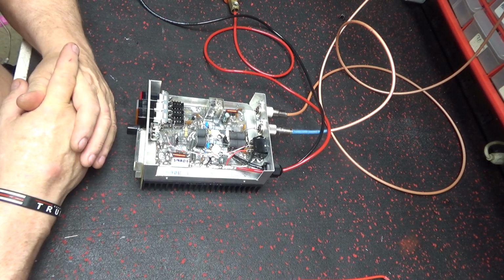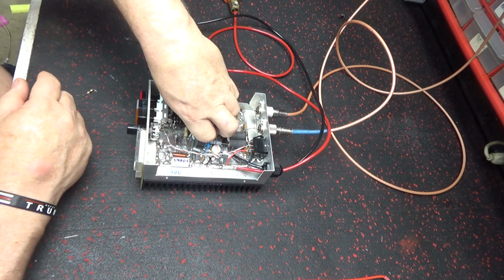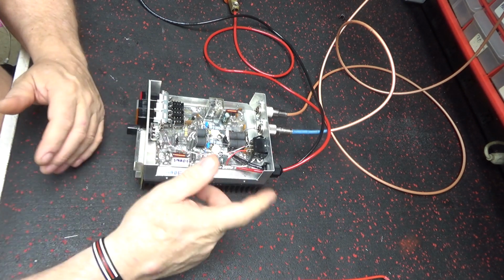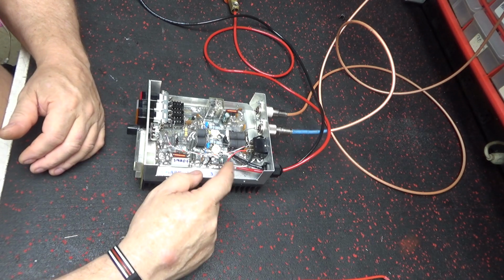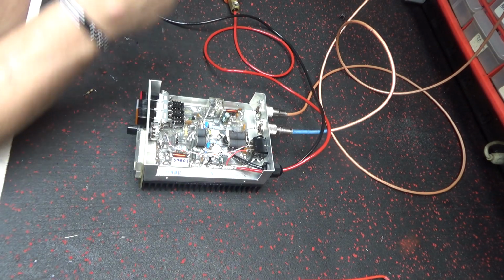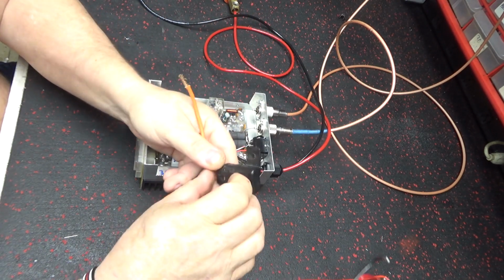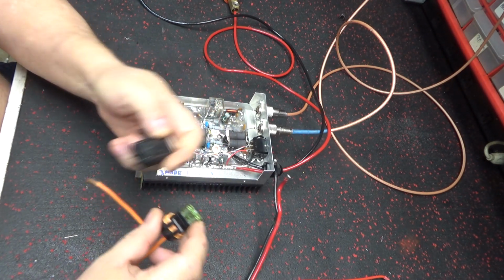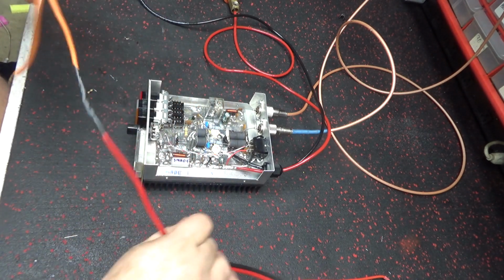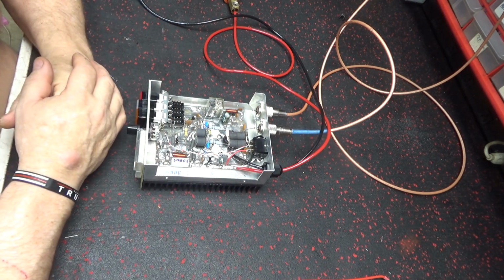And Texas Star parts is getting kind of hard to get now. If you ain't refurbishing them, mining for them or whatever, they're just getting hard to get. But anyways, I put a new transistor in it, added a diode here, put new power wires on it. The wires it had on it was this stuff here. And if you put a fuse in it, I guess that's what this is here. Put your fuse next to the battery and run, I would run a 40 amp fuse. I know 30 ought to pull it easy, but I'd run a 40.